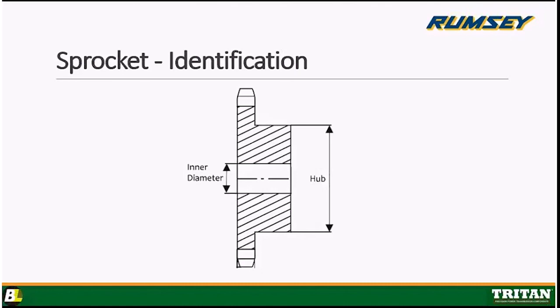Right. But that's something that maintenance people need to be taught as well. Just the handling of that bearing contributes to over 50% of the bearing's life. Yeah, exactly. This one isn't oiled as heavy, but this is a cylindrical roller bearing. And again, I don't want to leave my fingerprints on it, so that if it gets put back on the shelf, it wasn't the right bearing. It's in good shape. It's usable.